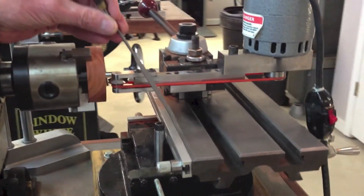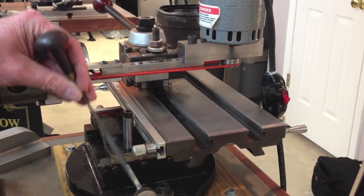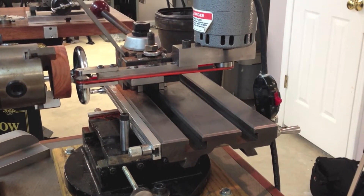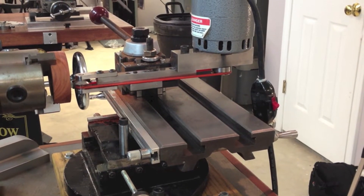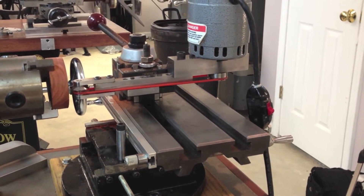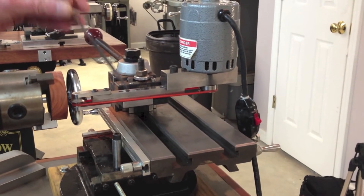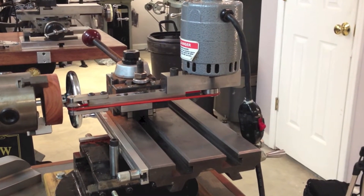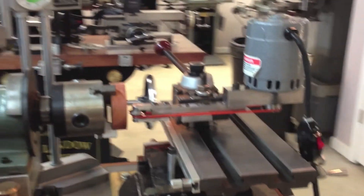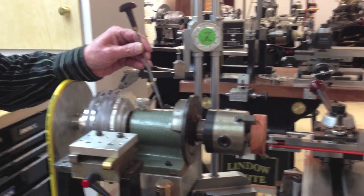The stops are pretty nice for this low-end cross slide — having stops and a lock that David and Dennis put on a bunch of them years ago. A little grease and a Teflon washer between a few of the friction pieces makes them not that bad. Most people have upgraded over the years, but this is still one of the ones they did many years ago.